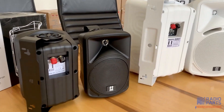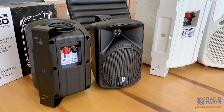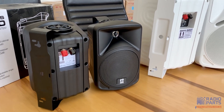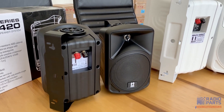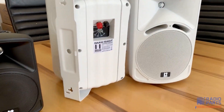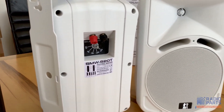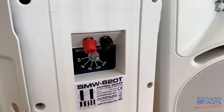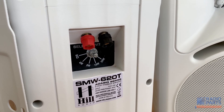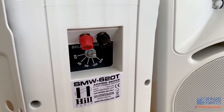Essentially these are great little speakers to run a small PA system. You could use them as an indoor/outdoor speaker, although they're not weatherproofed so you want to put them under cover. You can run them anywhere you've got an amplifier to drive them. In the 100 volt line case, there's a little transformer in the back of the unit, tapped up to 30 watts in the case of the bigger versions.